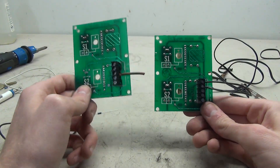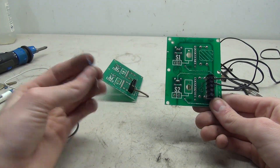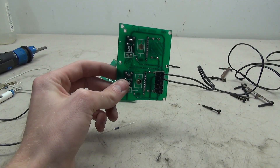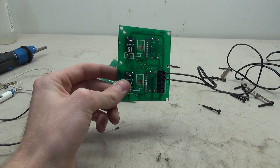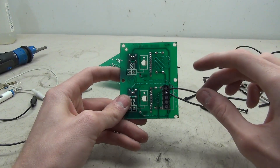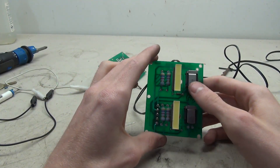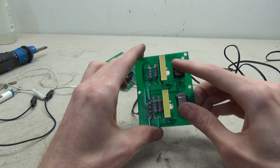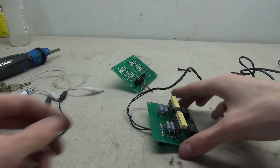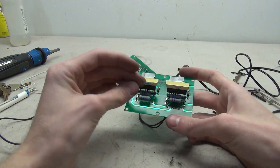Wiring these buttons is actually going to be really easy. If you want to power these with 12 volts, first you'll need a 100 ohm resistor and a 12 volt power supply — ideally a 12 volt battery. The connections are the same for both the intermediate and the terminal: the positive is connected to SS and the negative is connected to L1A. That's all there is on this side. Without modification you'll get a very dim result, so it's time to make the modifications. Whenever doing anything with the circuit, always kill the power first.